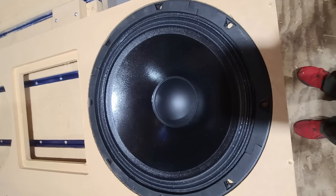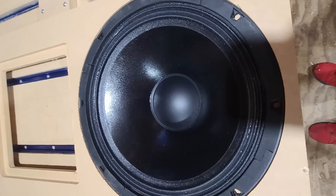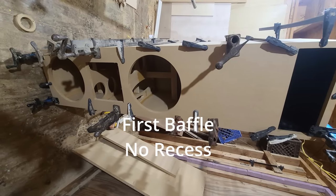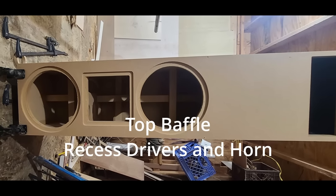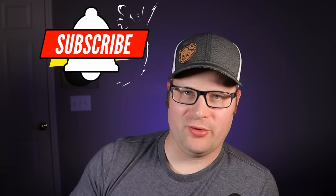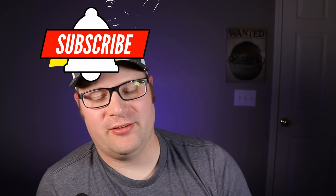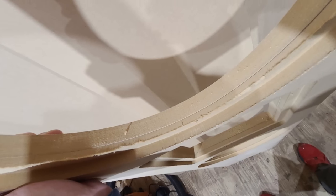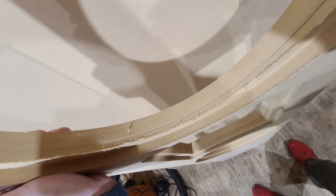That's not the last thing we want to do for good sound quality — we're going to do a double front baffle. By doing a double front baffle, we really deaden this enclosure, which is one of the main reasons you do it. But there are actually two reasons: one is to deaden the enclosure, and the other is that after I recessed those woofers in, I didn't have enough room for the screws to bite down. I really needed that extra three-quarter inch so those screws could bite into something solid.